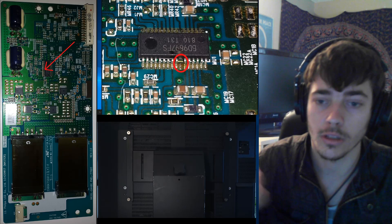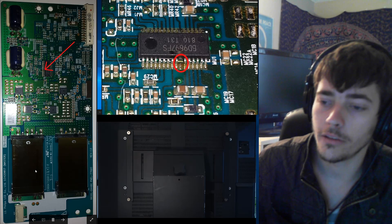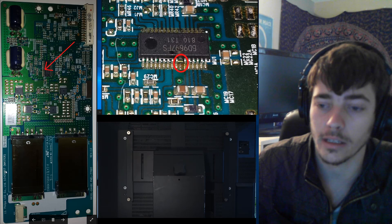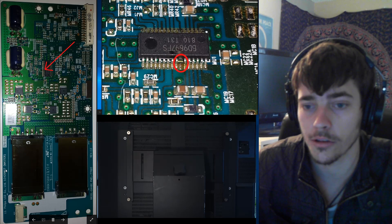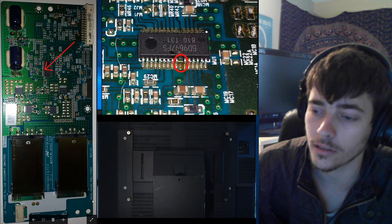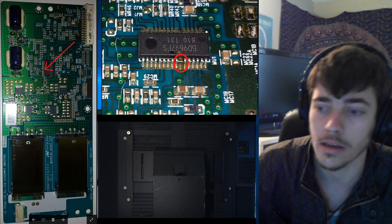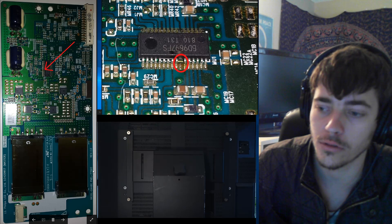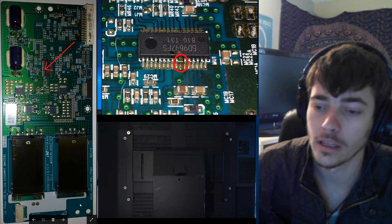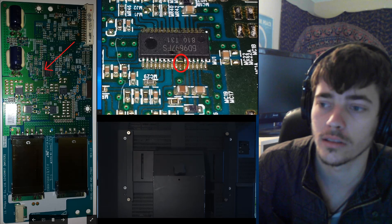At that point you just take the old board off, put the new board on, pop the three connectors back in, screw it in, and you'd be good to go. If you have a Philips TV like mine, you might see model numbers like this: LC420WX7, and the other important number — which will give you more accurate results — is 6632-L-0448C, PNL-T702C. This was the model of the board I'm using. There is another version of this LC420WX7 board that has an additional plug.